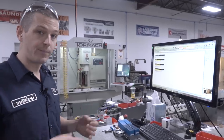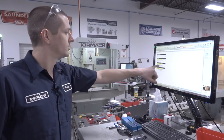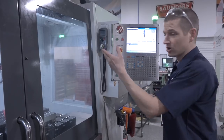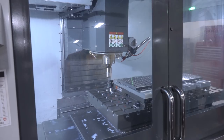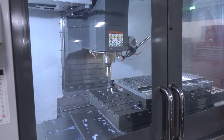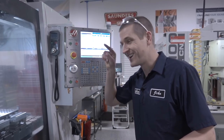We set our boring head diameter depending on what material and hole size. We've got these values that we know give us the final diameter that we want. We grab one of those values, which we call the OTS value — that's the Renishaw tool setter. So at .4749, we come up to the machine and in the Haas VPS, we've got a pre-written macro that goes down and measures the diameter it's currently at. That gives us our value — in this case .4747. So we've got that tool out two ten-thousandths of an inch, and that's what's awesome.